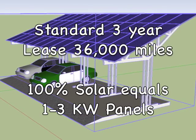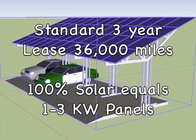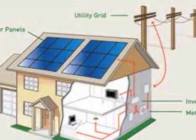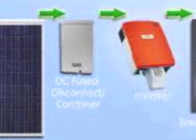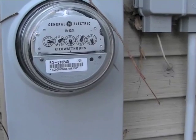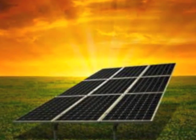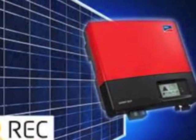The amount of solar panels you'll need varies a lot depending on where and how you mount them and how efficient they are. That's why we suggest 1 to 3 kilowatts of solar PV panels for a standard 3-year lease on an electric car — that will give you up to 100% of the charging you need in a year. The best and simplest way solar power is stored and delivered to your car is with a grid-tie connection. Every day, the electricity you make is collected from the panels, run through a grid-tie inverter, then to your electric panel and back through your meter, slowing, stopping, and even reversing the flow of power and money to your utility. You push more to the power company on sunny days and less when it's cloudy, but it all adds up. So all you need are the solar panels and a grid-tie inverter.